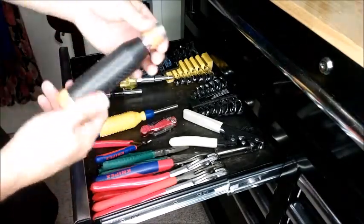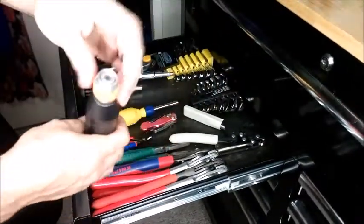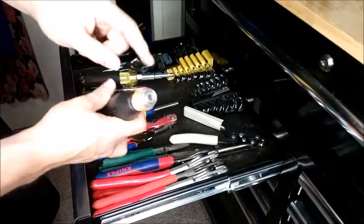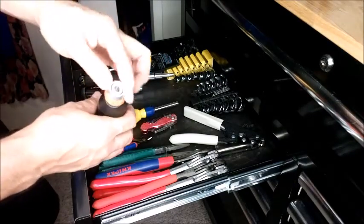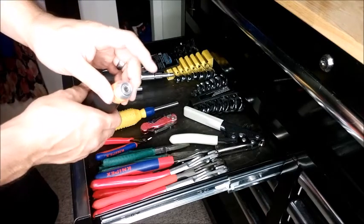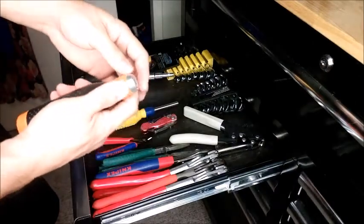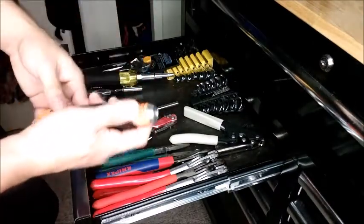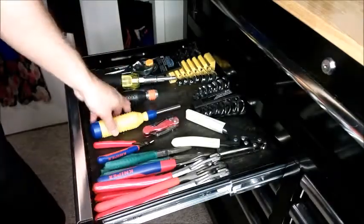Mega Pro. This one, I like this brand. I mean, same thing like my ratcheting screwdriver. This one locks into place. This is finicky. It's aluminum, not steel. So for whatever reason, galling happens. Galling is when metal rubs off on each other, or dissimilar metals can rub off, or I guess similar metals also. But bits can get stuck, which is annoying.